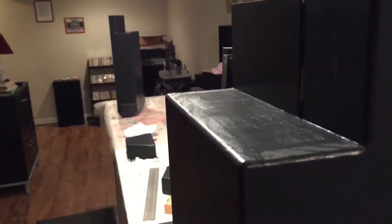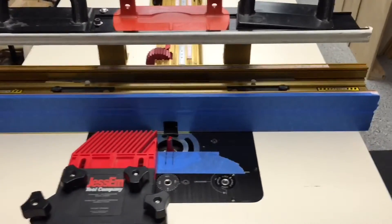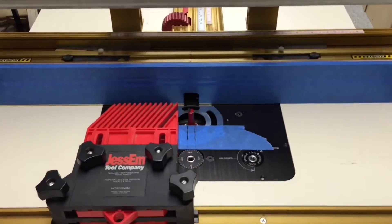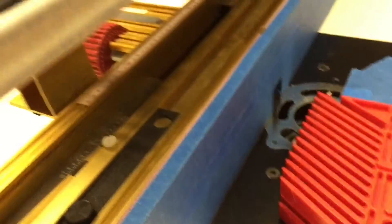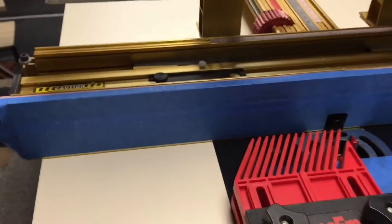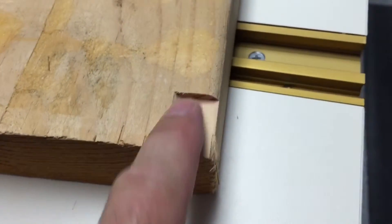Hopefully all of this will line up. To make this cut I'm going to use my router table. I've put tape all across the fence and on the upper fence so that I won't mar the paint I've already put on the rest of the leg. I'm using a double-decker featherboard to help hold the leg in place.